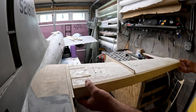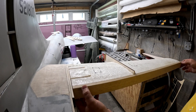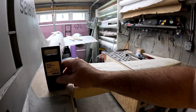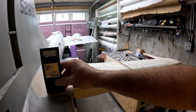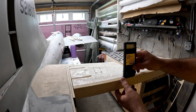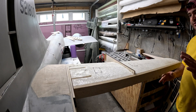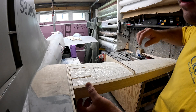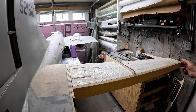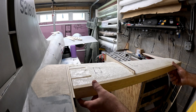We have the outboard rib in position. The inboard is pretty dang close — taking the incidence meter once again to see what we've got. It's showing zero here on the stub and zero out on the stab, so that horizontal stabilizer is pretty much bang on where it needs to be. There's just a small gap at the trailing edge, but we can account for that — we just need to come out a little bit towards the tip to get it to slide back forward.